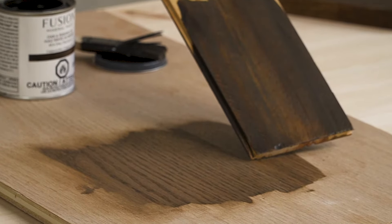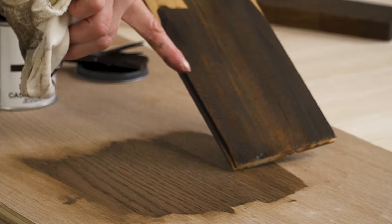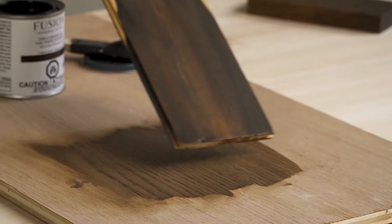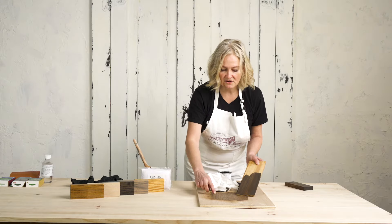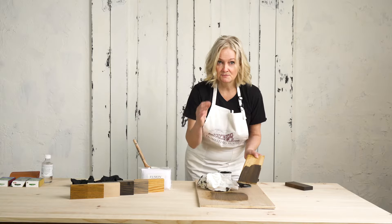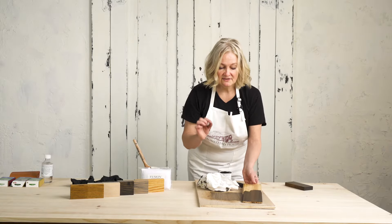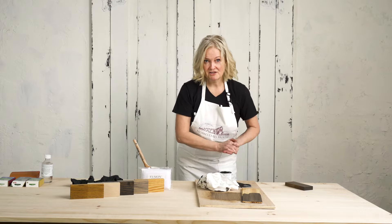You can see how the oak is very different than the softer pine. The color difference is simply due to the different types of woods — this is a harder oak, this is a softer pine, and you just get a different absorbency rate. So definitely do a practice prior to embarking on your project.